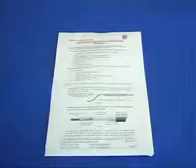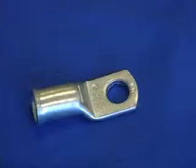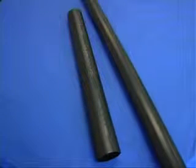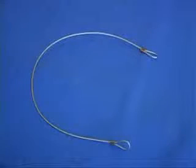The upper termination kit comprises a set of instructions, a roll of semiconductive tape, a 150 millimeter crimp lug, one 1200 millimeter long heat shrink tube, one 600 millimeter long heat shrink tube, an insulation friction cutting tool, and one roll of insulation tape or 50 millimeter packing tape.